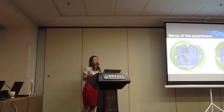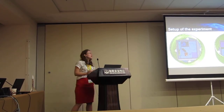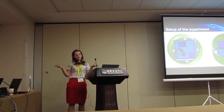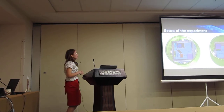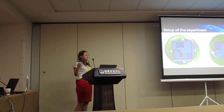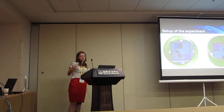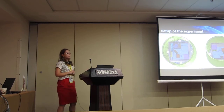From the laser, we have fiber optics attached to the optical system through an SMA connector. The beam is directed to the titanium alloy and acid core solder for melting and welding. We use a GoPro camera to record the experiment. For shifting the frame — because we want to melt and weld several samples — we use a linear motor. We also have electronics, for example the driver for the laser, and for in-situ measurements we use barometers, accelerometers, gyroscopes, and temperature sensors.